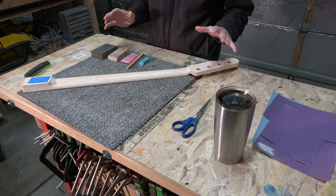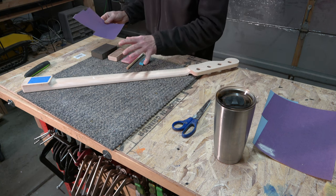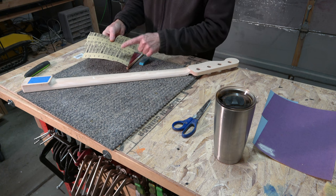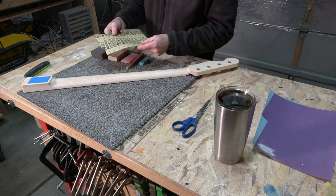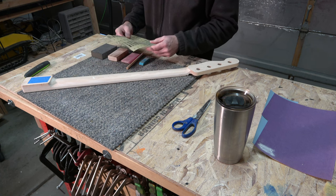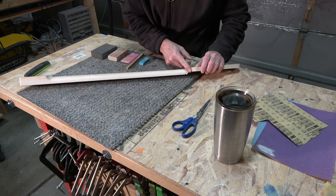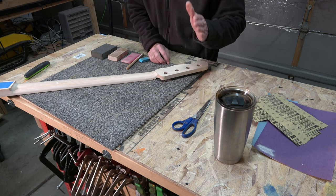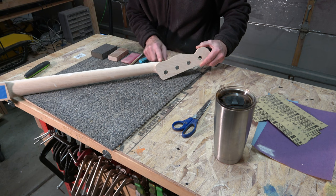It looks like I am ready to start the sanding process. For most of the sanding action here, I'm going to be using 220 grit sandpaper — this is your basic hardware store 3M Pro Grade Precision sandpaper, Cubitron 2. Nothing really fancy; it's what you can get at most of the big box hardware stores and it works just fine. In a couple of spots I have some really pronounced tool marks, so I'll drop back to 120 grit to sand those out. They're mostly around the volute on the headstock as well as around the edge.